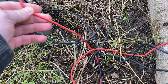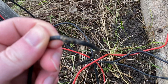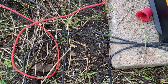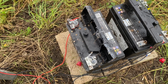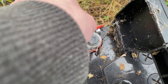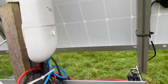The positive lead looks okay. But I've got to replace at least two of the other negative wires, because one of them is completely gone. I've got some ferrule connectors, some crimps — so I'll replace those leads. I'm also going to replace these terminals because they're rusty. I might just replace all of these 14 gauge wires since they're all a bit sad, and give things a bit of a tidy up.